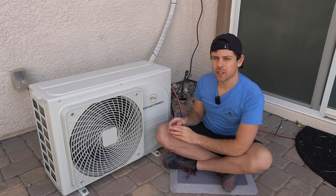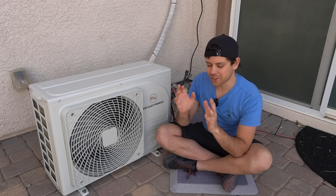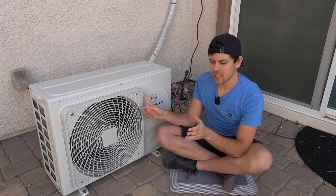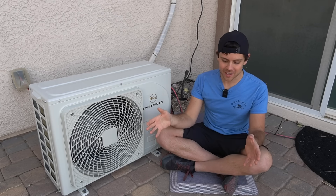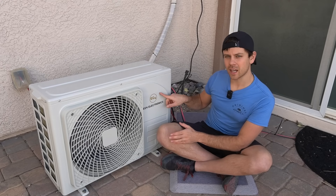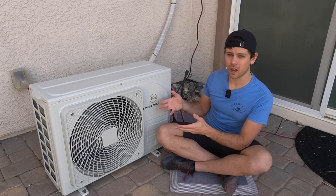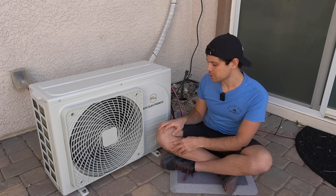Living off-grid, the two most difficult things are running an electric vehicle and heat pumps during winter — that's why I have a massive battery bank. The rest of the year is easy, but running heat pumps 24/7 and an electric car entirely off electricity is so difficult. Oversizing your array and getting a larger battery bank than necessary proves very useful at those times. This unit pulls about 19 to 24 kilowatt-hours per day at maximum settings, heating pretty much my whole house. Not running the Mr. Cool all the time — typically just in summer — saves me at least $100 per month.